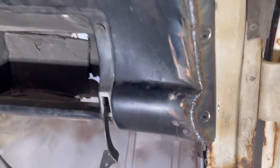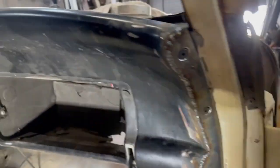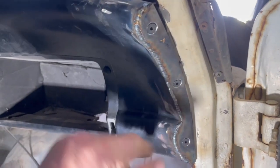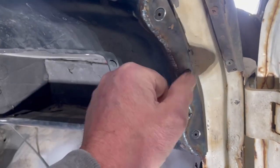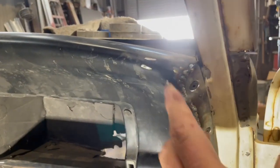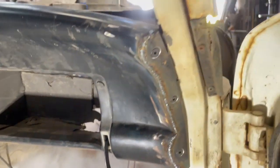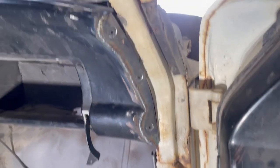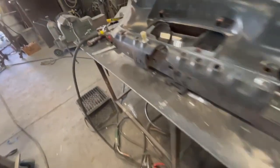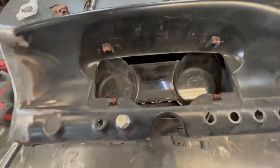I went and got some Allens — they're not that much smaller. I countersunk a little bit more but didn't get a whole lot of love there. So now I'm going to grind this surface here. While it's in, I'll get it as flat and nice as I can and do blending to get it close to the screws. I'll do the same thing on the other side, then take it out and work the bench side to get the contour right. Finished out — I think it'll work good.